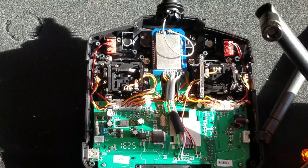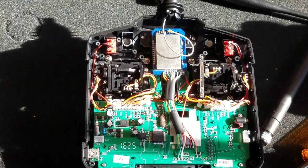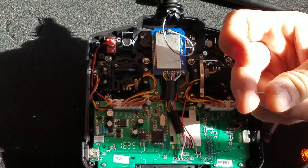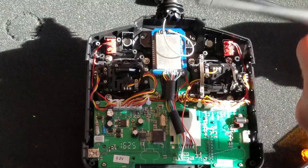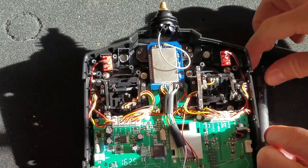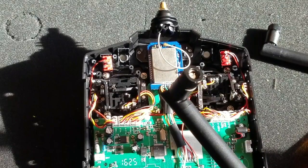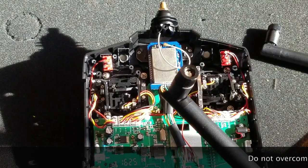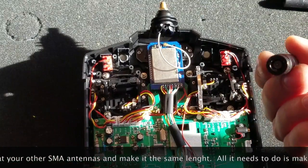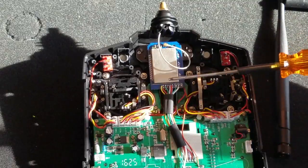You can then buy a 5 dBi antenna and you're fine. Unfortunately I got an RPSMA antenna thinking it was SMA, so what I did was take a standard pin header, pull out one of the pins, and shove it down into the hole in the connector. I clipped it and essentially made my own SMA antenna. Just make sure you clip it to the right length — compare it to other antennas you have. I also flowed a little solder onto the tip to make it a tight fit when you screw it down.